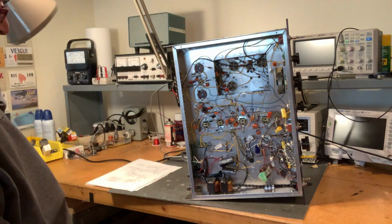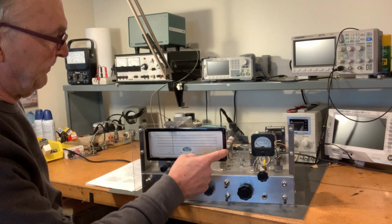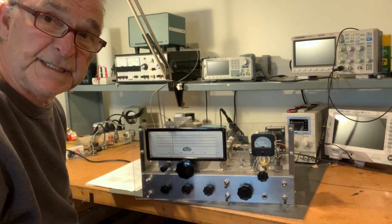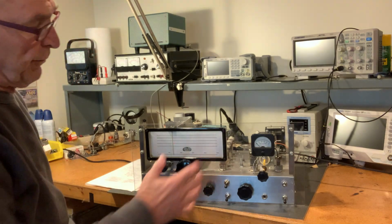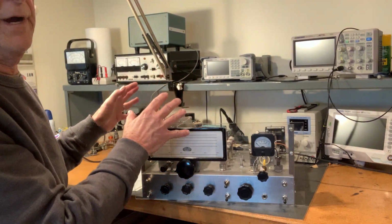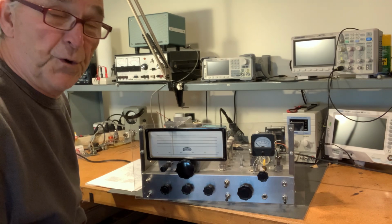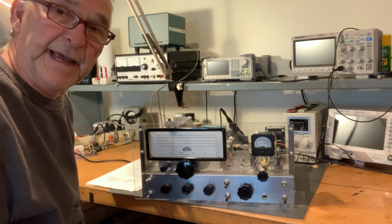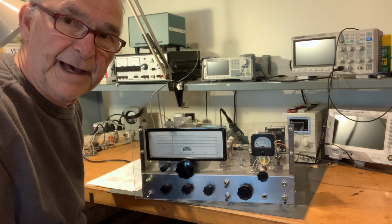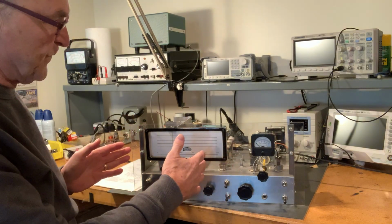So when I built my version, instead of putting the dial in the middle, I put the dial over on the left, which is typical of Ted Crosby's designs, his HBR-14, 16, 11, and 8. They're all on the left side. He had everything over here, so it went into regeneration without any difficulty. In this version, there are no problems getting the RF amp, the amplifier and the mixers to go into regeneration. It has a lot of gain. Mechanically it would have looked pretty in the middle, but electrically I think it works out better over here.